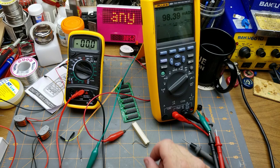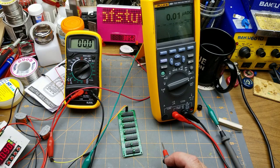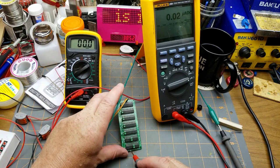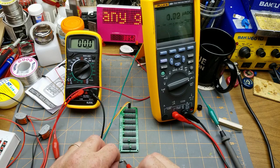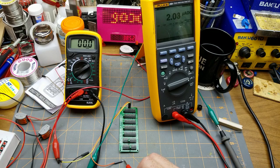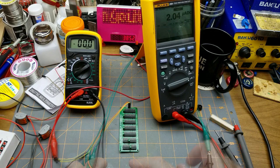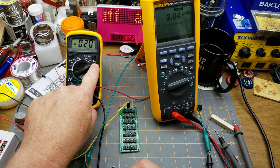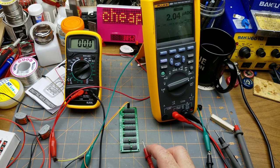Let's try a low current test. I've got almost 11 volts and a 5.4-meg resistor on there. This meter says I have 2 microamps. Holding that and switching leads — I don't even know if this guy can read that low. Wow — 2 microamps! Okay, that's actually impressive.